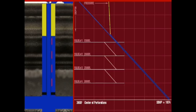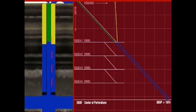When the annulus fluid is unloaded to the first valve depth, the casing pressure will have reached its designed kickoff pressure, in this case 800 psi. This pressure is sufficient to lower the casing fluid below the first mandrel and allow gas injection into the top valve. This injected gas causes a lighter gradient in the tubing, allowing the well to unload the kill fluid entering the tubing string from the lower valves as the well continues to unload.